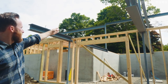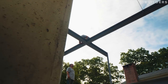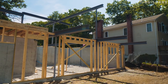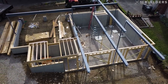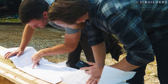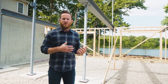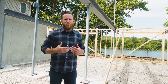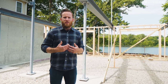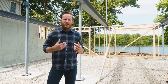Working our way back, we have that W-8, which is the beam that runs in that first floor ceiling or second floor deck. That's got a short beam going off the front and a long beam coming off the back that supports a small cantilever above this rear deck. The whole reason behind this is we hadn't finalized our kitchen, dining, living room layout. In the original drawing, we had a bearing wall dividing the front dining room from the rear kitchen, and it kept getting in the way of our design. So we said, if we can structure this so all the interior walls are non-load bearing, then we have the flexibility to really design the first floor any way we'd like — that's why we opted to do the additional steel in that first floor ceiling.